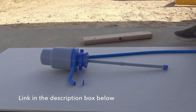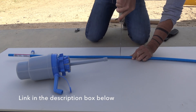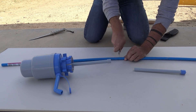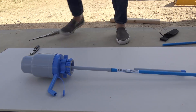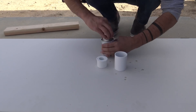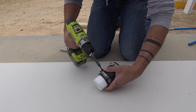The water supply is going to come from a five-gallon jug, so I got this dolphin pump, which is meant to be mounted right on the neck of the jug. I wanted to make it a little longer so it could go through the sink, so I cut a piece of PEX tubing and it fit right into the tubing that came with the pump. I also needed to extend the neck of the water jug up into the pump itself, so I used some PVC pipe and a rubber coupling device with two hose clamps.